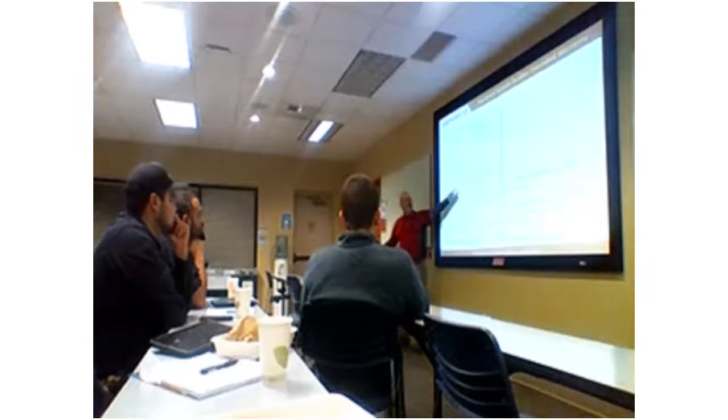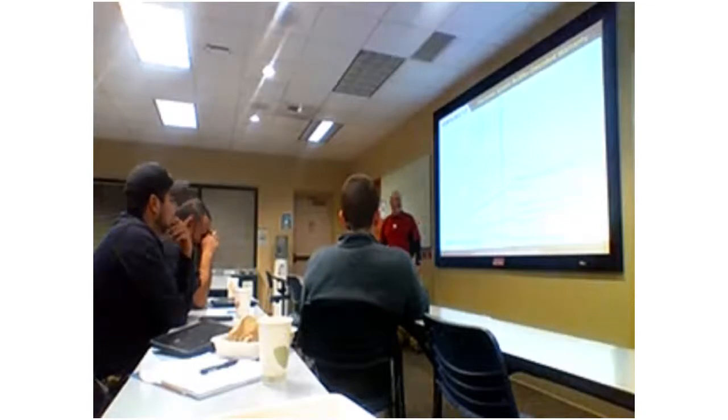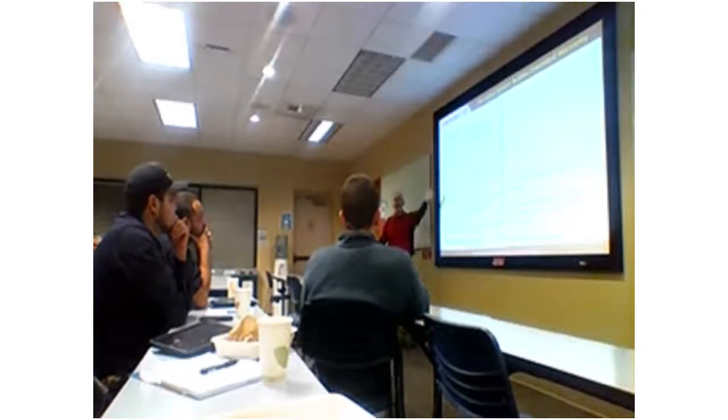Who did the job? Who went through the city multi-course? Your pressure test and evacuation details have to go on here. Who installed it, who the owner is, who was the engineer? Everything with a red asterisk has to be filled out, or Mitsubishi kicks it back. If you forget to put an email in here, it comes back.